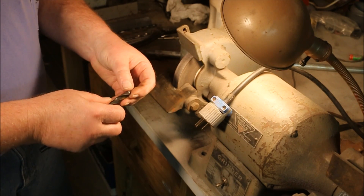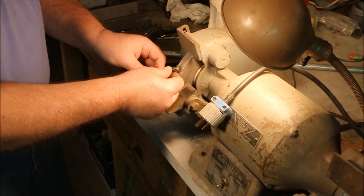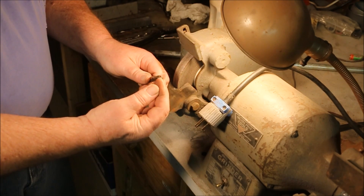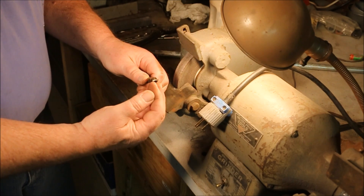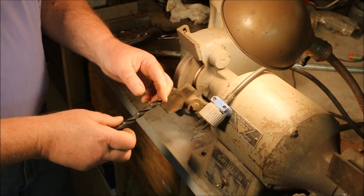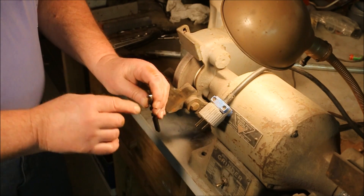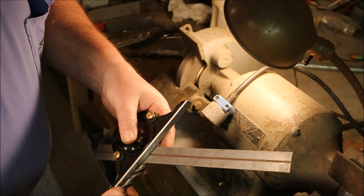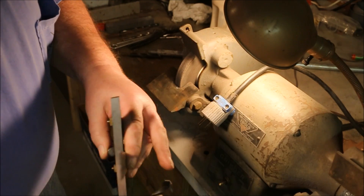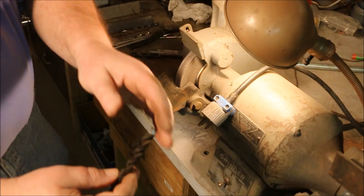Because this drill bit was broken off, I had to take off quite a bit. Typically it's just going to be zip-zip — just take the drill bit, go up, go up, check and make sure it's centered. We want to make sure that the center of that drill bit — the conical point between the two surfaces — is dead center on the drill bit. That center point is the bearing that the drill bit rides on when it's doing the cutting. If it's off to one side or the other, the drill bit orbits and drills a hole larger than its diameter. By setting the drill bit against the scale, I can confirm I'm centered. My point is in the proper place, my relief angle is 15 degrees, and I now have a sharp drill bit.